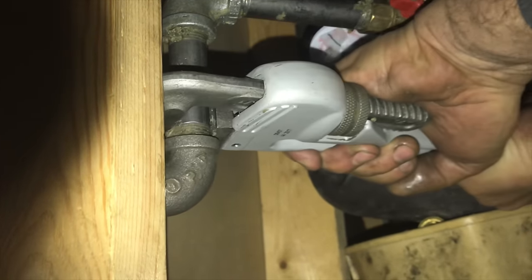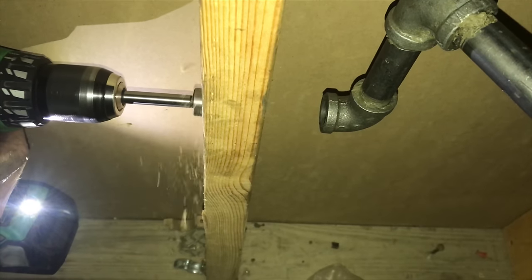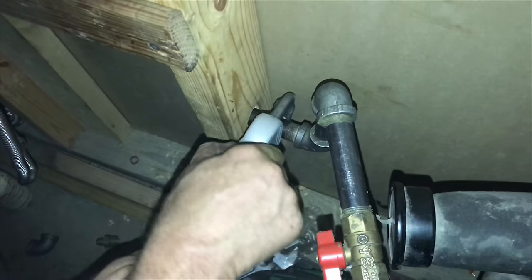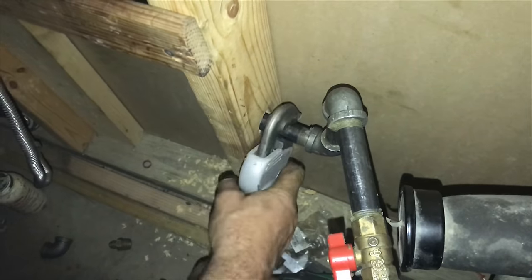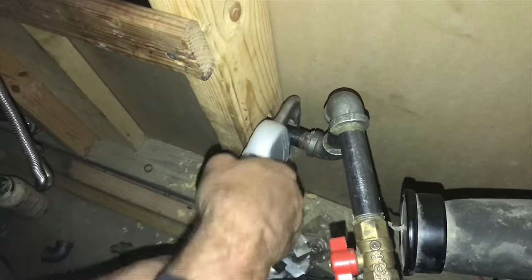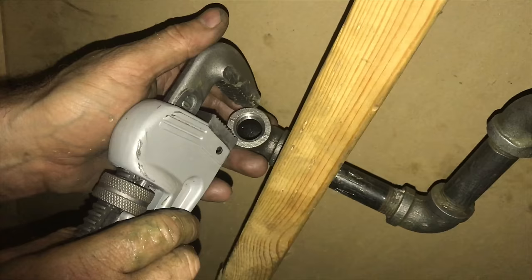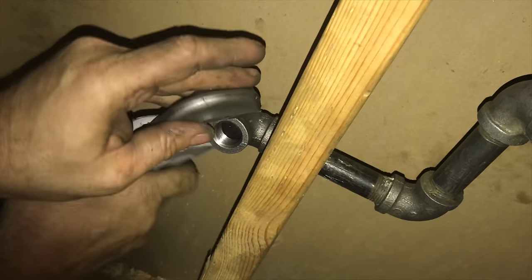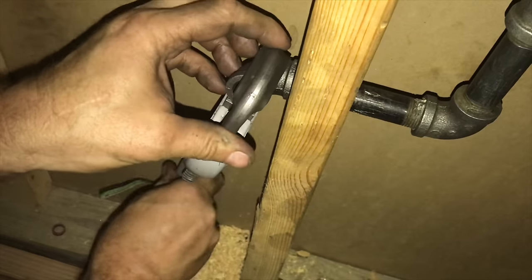You can see how sharp this pipe wrench is and how well it works. Now I'm going to orient this very carefully. I'm going to drill through the stud and use the stud as a support for this pipe — that way if somebody leans on the pipe it's not going to leak. You want to make sure that your pipes are well supported so they can't be moved and start leaking. At the other side of this pipe I'm going to put a 90-degree fitting straight down and then put a brass nipple in, so I can attach the flexible gas line from the space heater. The flexible hose is there so you can service the space heater if you ever need to move it away from the wall, and it will be inside the wall so it'll be protected from damage.